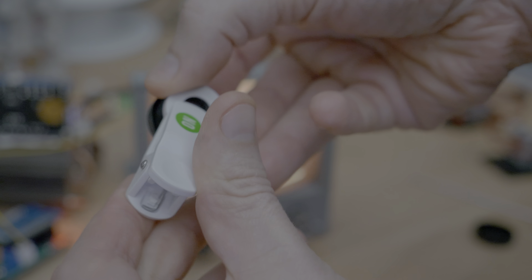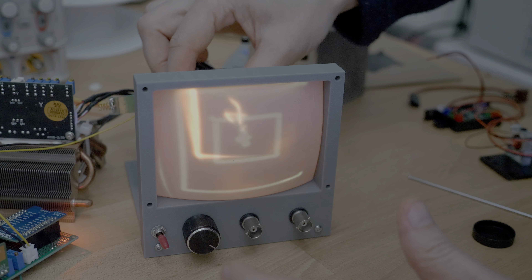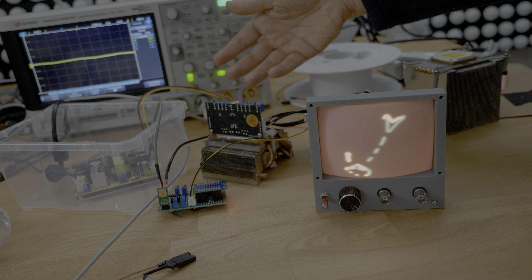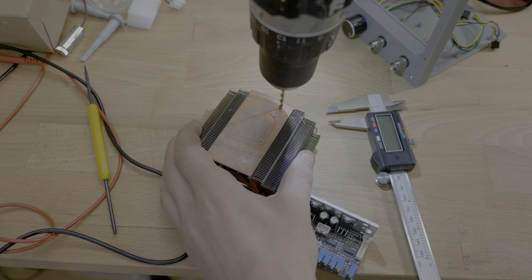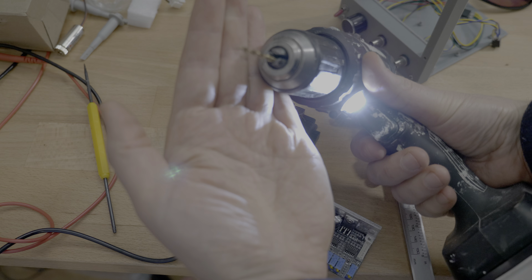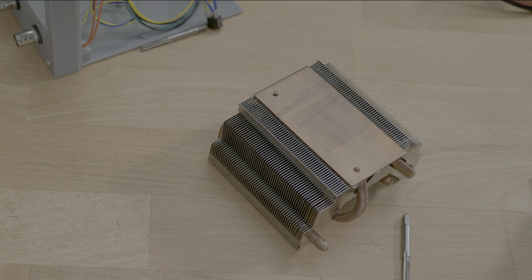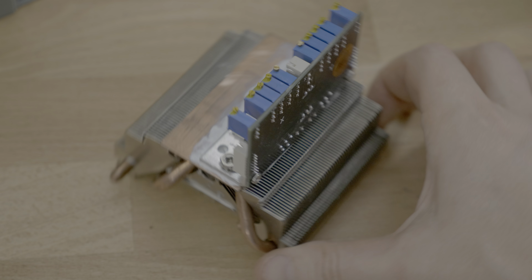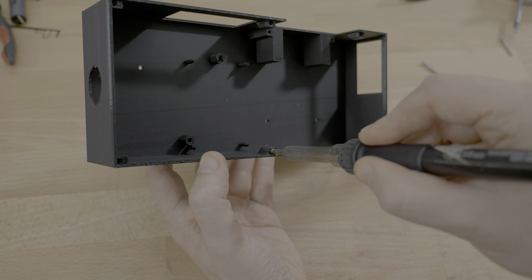To solve that issue, I thought of putting a wide-angle lens in front of the output — you have these clip-on lenses for your smartphone, a 180 degree fish-eye. If I put this in front of the mirrors we can get a wider angle. This might work, but it also seemed we need a bigger case for all this chunky stuff. Although I like that mini TV style, I went for a practical and modular approach this time. This is also the first time I used threaded inserts for 3mm bolts and I must admit I like them.